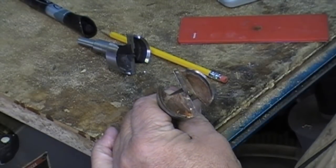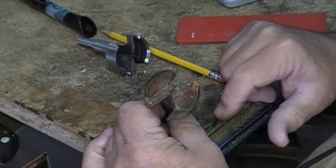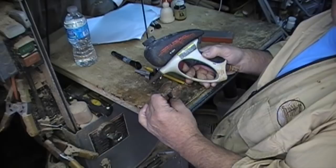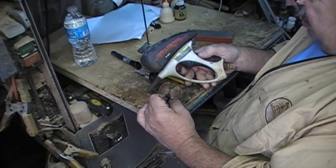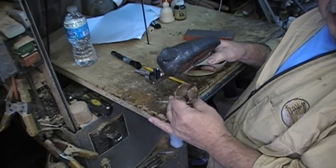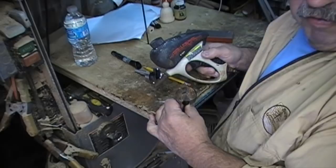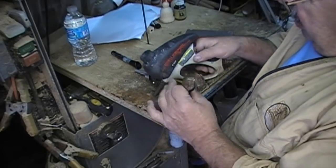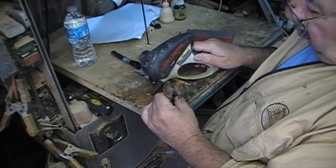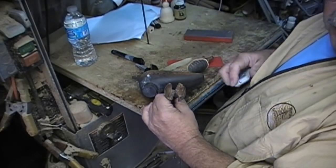If I'm really particular about the look of it and I want to clean it up and get a little pitting rust off the outside, I wouldn't sand it — I would soda blast it. This is another little cheapy sand blaster, another one of my Harbor Freight Specials. You load the baking soda in the top, put about 70-80 pounds of pressure on it, and you soda blast. It's safer and easier than sand blasting and accomplishes almost the same thing. Soda is softer, doesn't eat away so much material, won't change the configuration very much, but it will clean up all this rust.